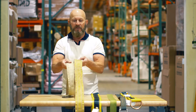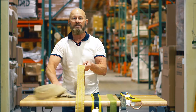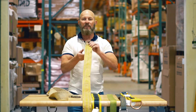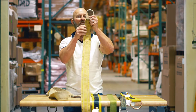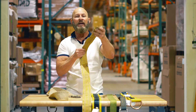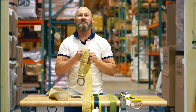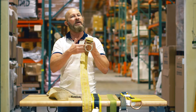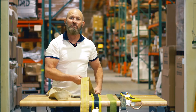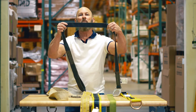You can see here that this one is also faded, but you would have to inspect it to make sure that there's no cuts. If I looked farther down the unit, I would see that there is a burn mark on the end and burn marks inside. You can also tell that through this unit there are little hard brown spots. That tells me that somebody is welding while using this product, and this is not the right beam strap to be using. If you are working around hot materials, I would recommend you go to a welder's style beam strap.